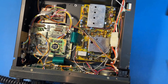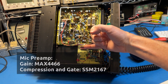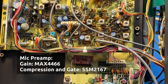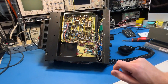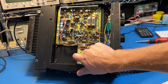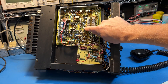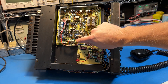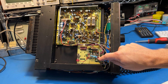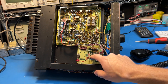Let me turn this around and show you the microphone preamp. This is the mic preamp I added right here — it's really small, about the size of the tip of your pinky finger. I had to add a 5-volt regulator here, just a regular 7805; the current consumption is so small you could use the lower-current version too. I intercepted the gray audio cable, which goes to the audio preamp circuit with the mic gain knob — just cut it, wired it into the preamp board in and out. It continues on over to the microphone cables. These switches are for the tuner so you can put it into different modes for like an SGC tuner or SEA tuner or whatever.